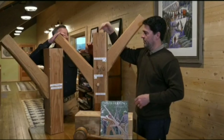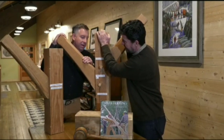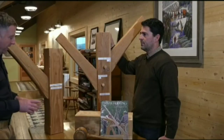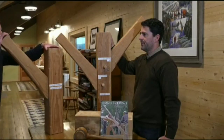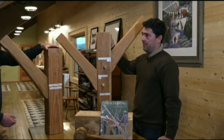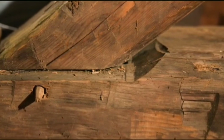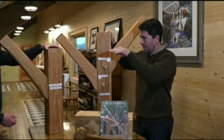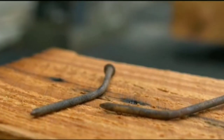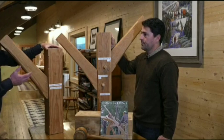It feels kind of steady, but let's put some weight on it — you can hear it straining. If you've ever built a piece of furniture using screws, like a little table out on your deck, you come back a year or two later and see the same thing: the screws are loose, the wobbly table. You're building a structure for the ages — it's going to continue to perform the way it was designed to perform even though time and the elements have had their effect. You're still relying on interlocking joinery versus a threaded fastener that was tight at one point but has now loosened or gapped. Wood is hygroscopic — it absorbs and releases moisture just like a sponge.